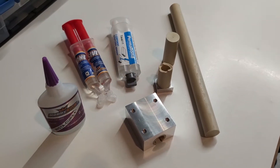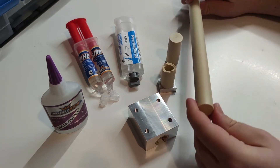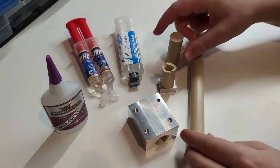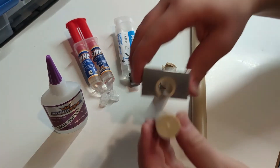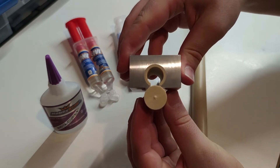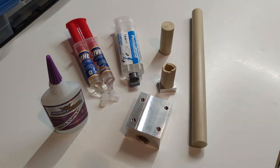I decided to buy a plastic rod from company IGUS, who make polymer plastics for sliding applications. I found a suitable rod with 21.5 mm in diameter, which would leave enough material around the shaft for a good sliding surface. It was not cheap — around 60 euros for 1 meter — but the whole material cost was still substantially lower compared to buying original bearings of that size.